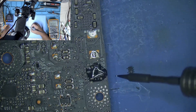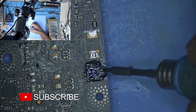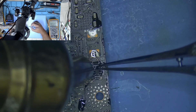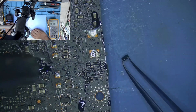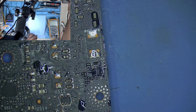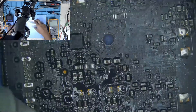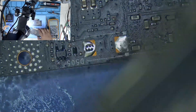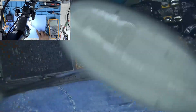To install the AND gate on the PCB, I first applied some flux and added some leaded solder. The temperature is set at 420 degrees C and airflow is at 40%. I started by heating the installation area and melted the solder, then dropped the AND gate in place. I gave it some final touches by adding more flux and applying the iron to flow the solder evenly. After soldering, I cleaned off the flux using 99.9% isopropyl alcohol and a brush. It's good practice to inspect your work after the chip is installed.